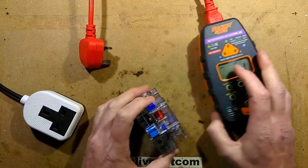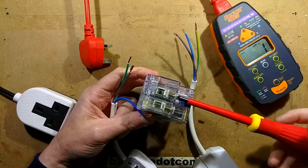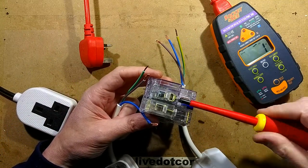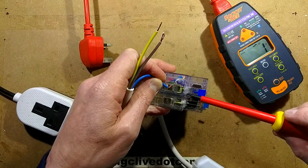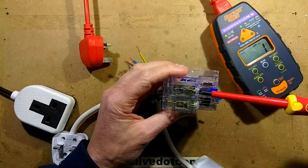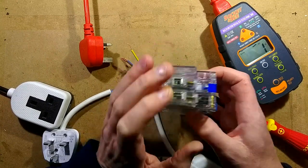Now let's do it on this RCD. I believe this is 30 milliamp, and to hook it up we'll use this test lead. These are the rising clamp terminals — as you tighten them they rise up. A little bugbear of mine is that when you tighten this up blind, such as over a bus bar, it can feel like it's tightened completely but not actually gripped the wire. Unfortunately in the UK all our electrical regulatory bodies are really just office workers — they don't get involved in doing electrical work, so someone has to tell them before they do anything about it.